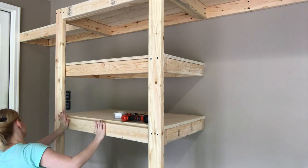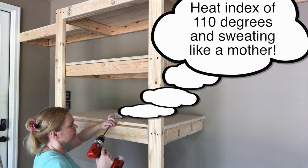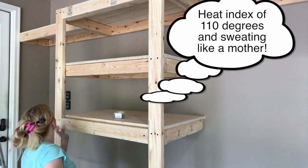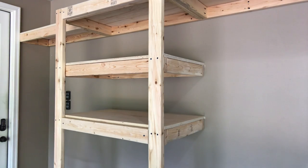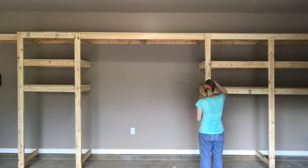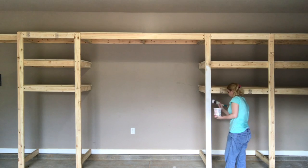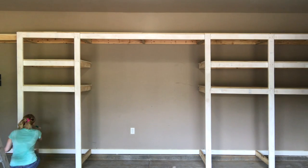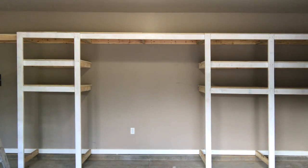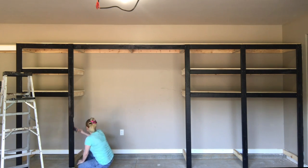The first thing I had to do to convert these into cabinets was to create a face frame, or a flush surface for the doors to rest against. I did this by adding a horizontal 2x4 in between the legs at the location where the doors would rest. Once that was finished, I went back with some wood putty and puttied over all the knots and screw holes in the frame. Then I did a coat of a good stain-blocking primer, allowed that to completely dry, and applied two coats of paint. I'm only painting the areas that would be considered the face frame of a cabinet and left the shelves unfinished.